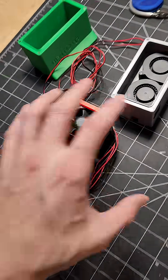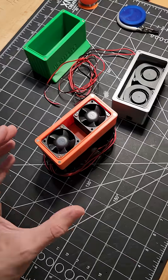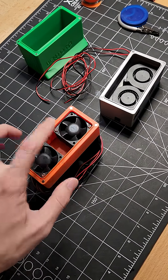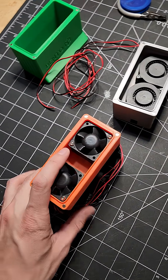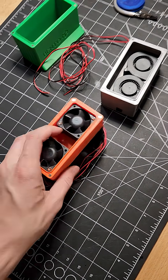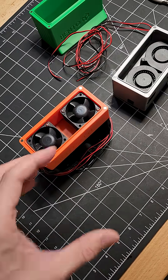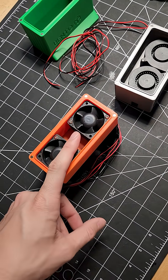Upgrades to the bento box. I have two different versions of the bento box here — at least the lower part — because I've been running these 4028 fans for a while now. One thing I really noticed is they are a little bit noisy. Initially, the design was with 4020 fans. Even those were kind of noisy, and these 4028s are definitely a lot noisier.